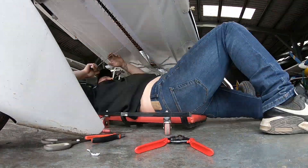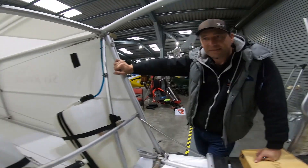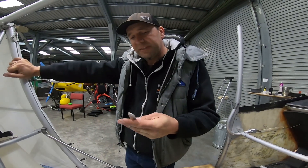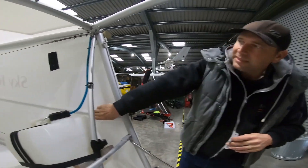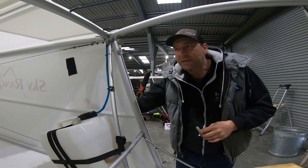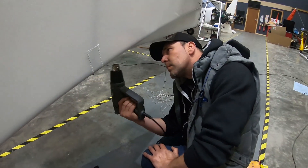What we're going to do now is secure the front end — click it into place — then we're going to rivet in what we can, just give it a bit more tension. Then we're going to fit the transit bar. These are the brackets that fit onto these ribs, and that just pushes the outside out a little bit more, gives it a bit more stability. Then we're going to have another pass at the fuselage to get more tension into it.